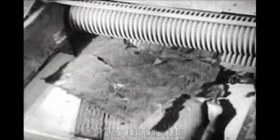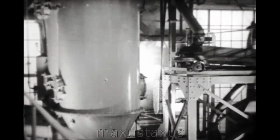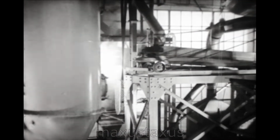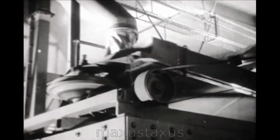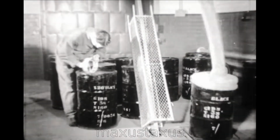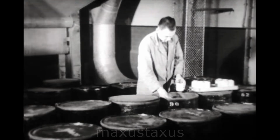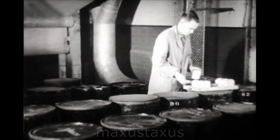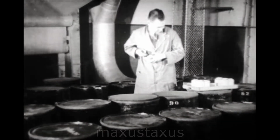The brittle sheets are then ground up, and separators and screens remove both the fine dust and oversized particles. To obtain uniformity, the material is bulked, and after weighing is packed in drums for dispatch from the factory. Once more, however, a sample from each drum is taken to ensure that Bakelite moulding materials as sold comply with recognized standards of quality.